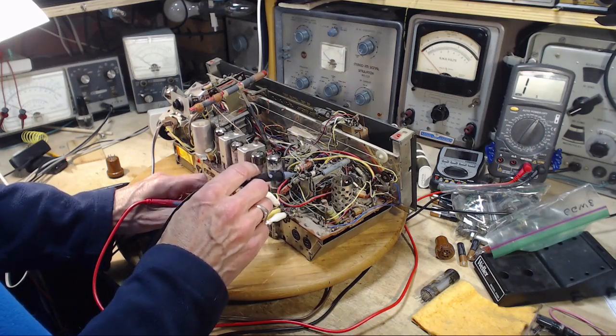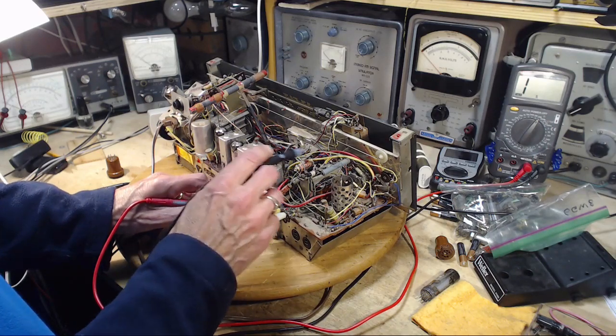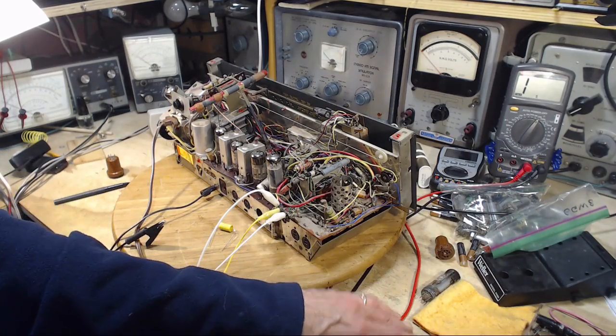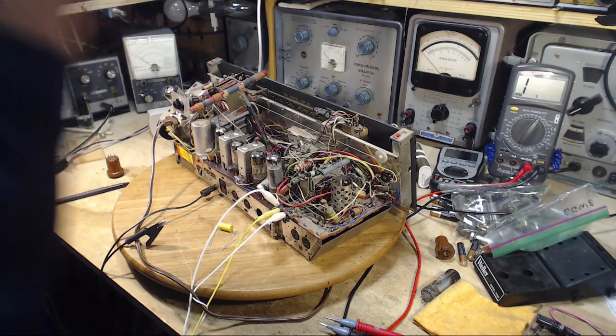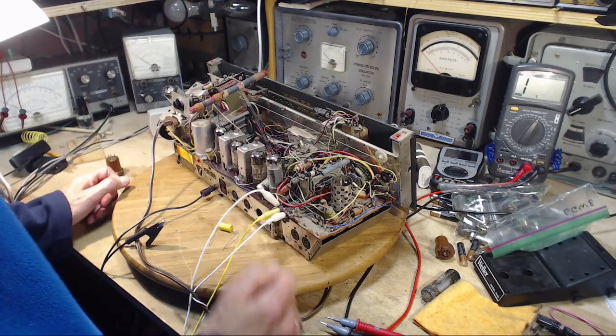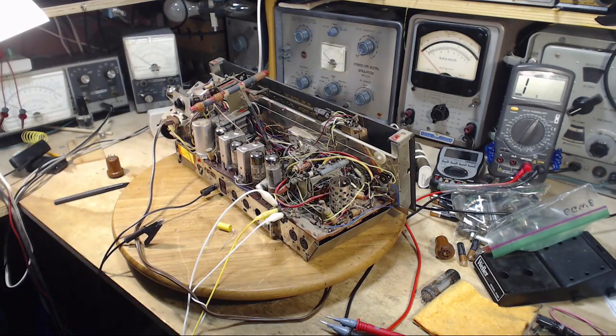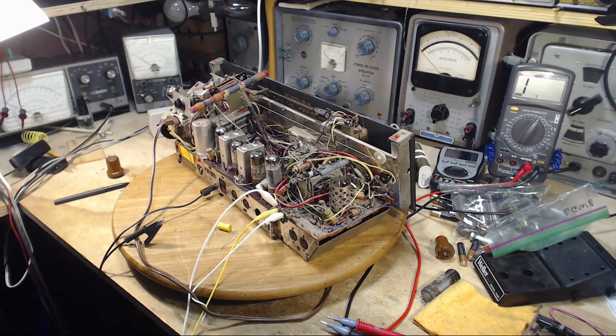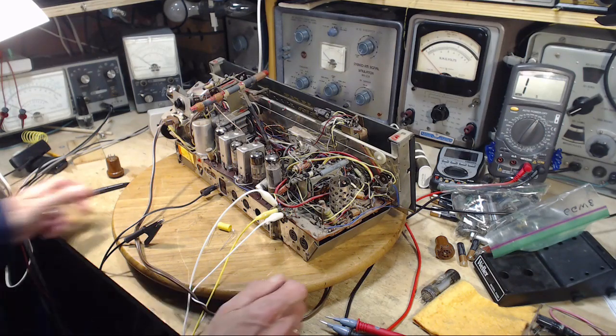Well, maybe I'm going to open these two capacitors here, and we'll put a tester on them, see what we can find out. And can I put 630 volt? I bet you I can. Modern 630 volt capacitors. After all, this is like a 50-year-old 1,000 volt one. You think it's still good for 1,000? I'm not good for 1,000 anymore. Yeah, let's pop those open.